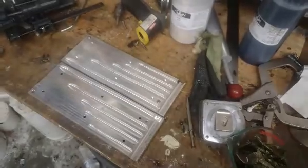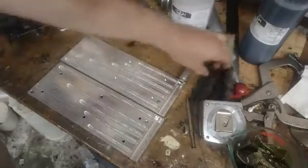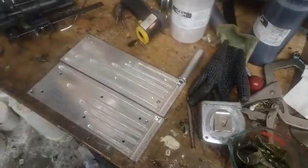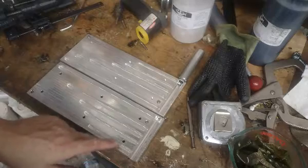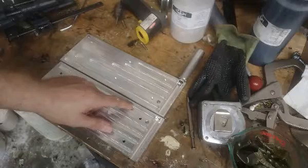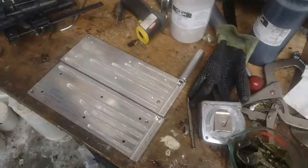Or if you don't want to do that, order a sprue extender. Or if you already have one, just use one you already have. That's what I think is going to happen — I'm going to shoot it and this cavity is going to freeze off pretty quickly, this one not too bad, this one is going to take a while, and these two are going to take a long time and continue to draw plastic.